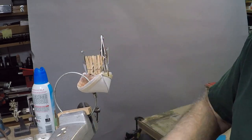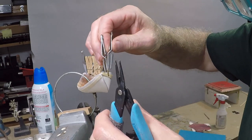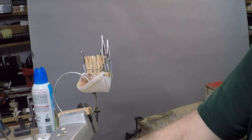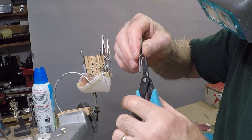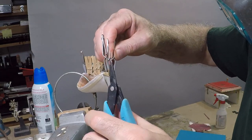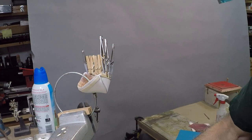Now, I usually install the planks in 3 stages, starting at the midship station, then working out to the ends. In this case, I've already put on the aft end, and here you just see me gluing up the forward end. And as you can see, the operation takes a lot of clamping, and there's a good reason for that.